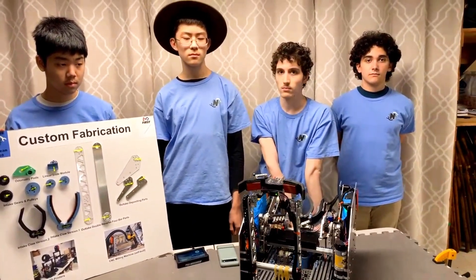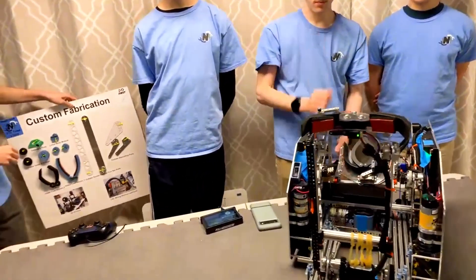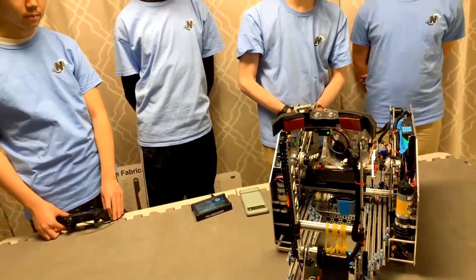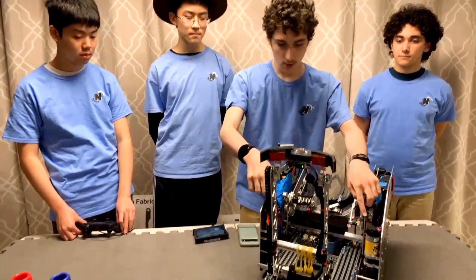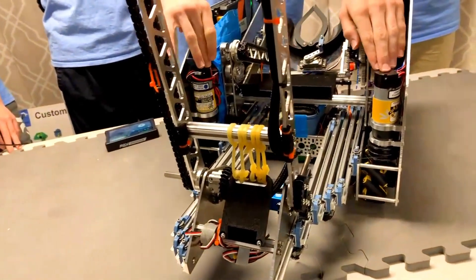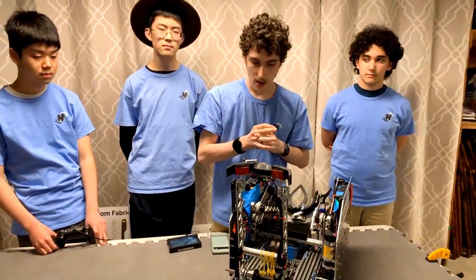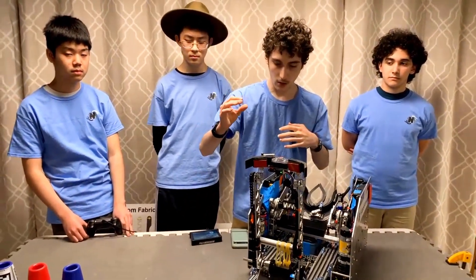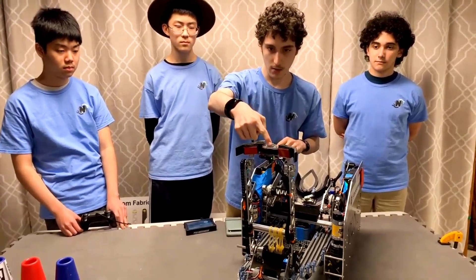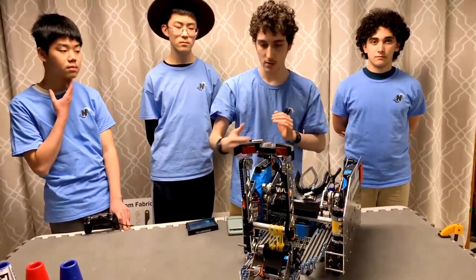Before we go onto your transfer and deposit, let's talk about the software. I see a REV color distance sensor right below your claw, and I'm sure you guys are running encoders on your motors. Talk about the automations you have in your intake and how you use sensors to do those. For these motors we use either set power directly for going in and out, or go-to-position where we need to know how far we are and how far we need to go. In autonomous, we extend out at partial power, and once we get close we slow down. Then once we're at some distance, we detect the cone, calculate how many more encoder ticks we need to move, and move that many ticks more.